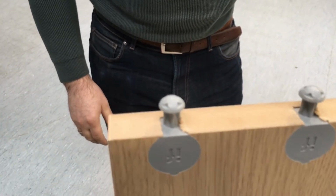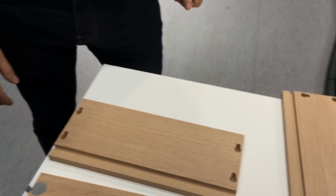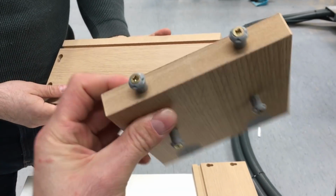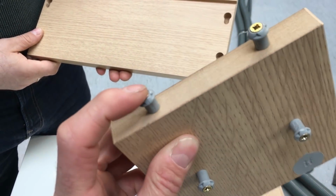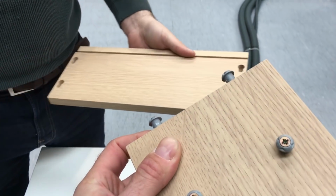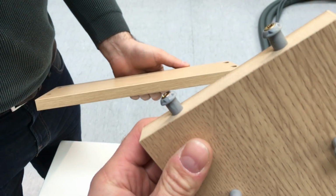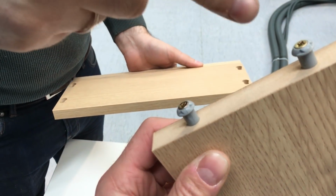And so you have the option of that face CNC'd fixing, or there was an edge one, these edge ones up here? So they do the same thing. And is that a special screw there, or is that just a wood screw? Just a normal screw. But it would have to be piloted with a 3mm? You just screw it in? Yes. For this, you do 6mm edge drilling to insert the component itself, and you reinforce it with a screw.